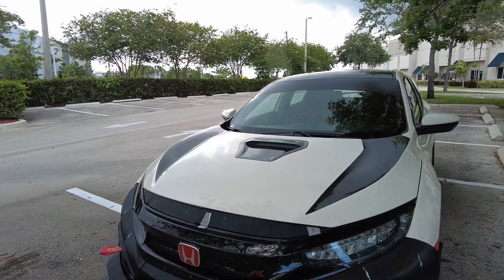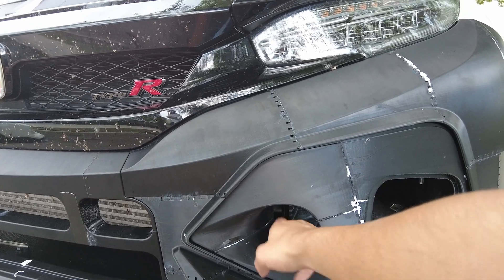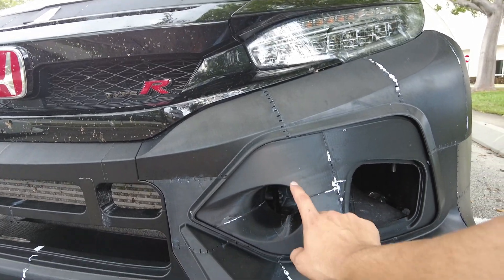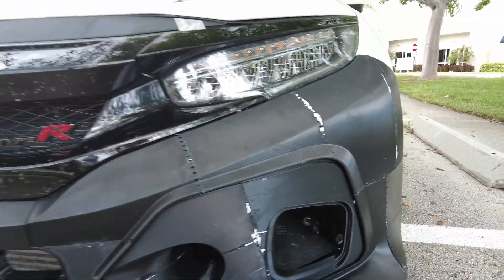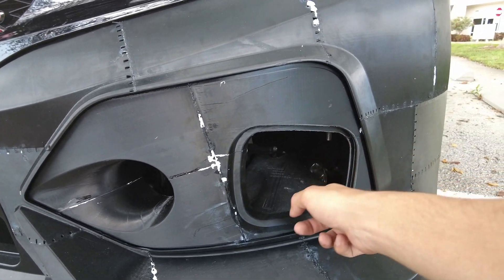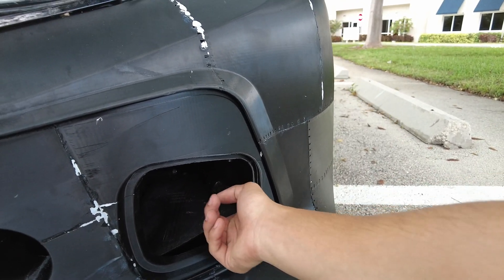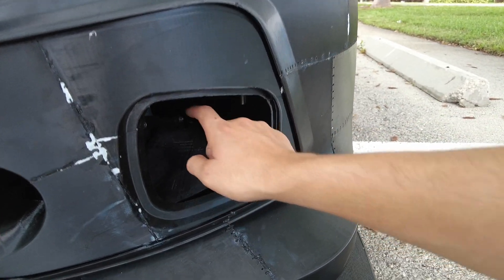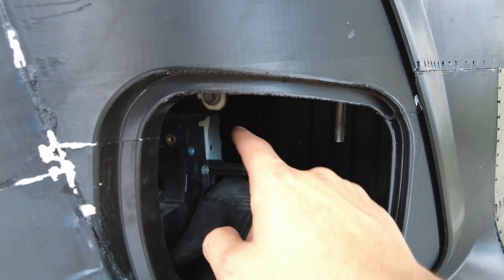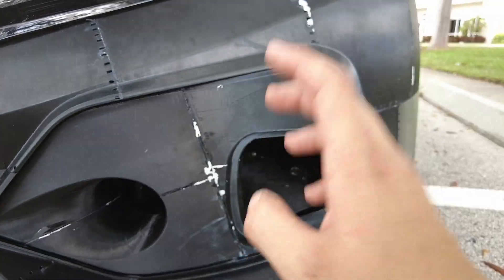In the CAD and the original design, this brake duct right here is for a three-inch brake duct for the orange hose. What we're probably going to do is, rather than carry it all the way to the back of the rotor, remove this part right here — this is the OEM brake duct. We're going to end up making an adapter for the tubing so that we don't have to create that metal bracket. It'll make life a lot easier.